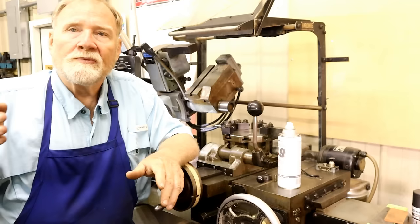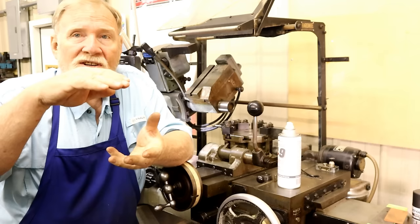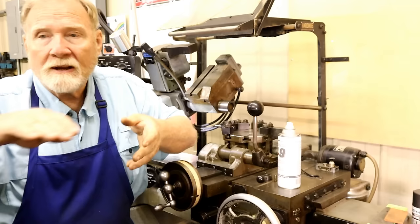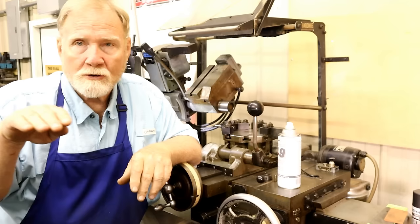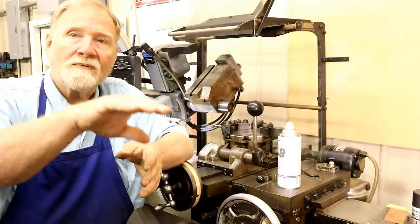When we were filling the mold up and it blew out, the weight of the liquid hot metal, it is like water, rose and rose and rose until the hydrostatic pressure forced it to go out that joint between the 2 halves of the mold. The wood didn't have a thing to do with it. It could have been steel. It could have been titanium. It didn't matter. The sand joint could not contain the volume of hot metal that was being poured into it. That's why it blew out.